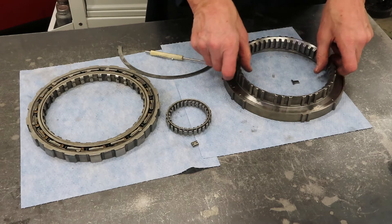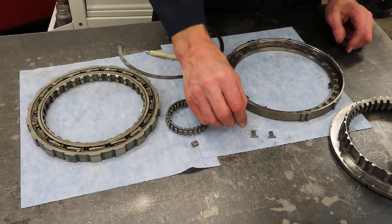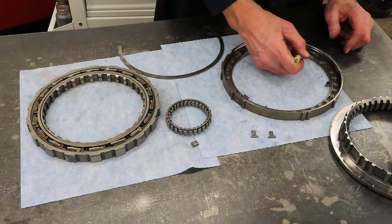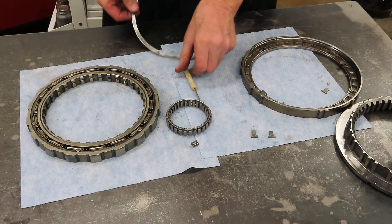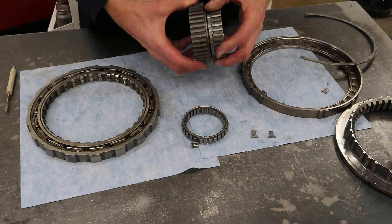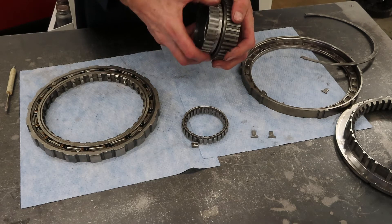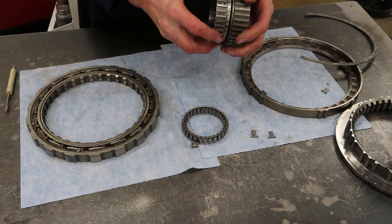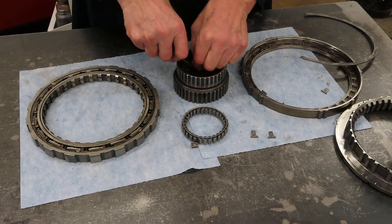Here are the elements and little springs that hold them in their little pockets. The element rides up its slope then dives off — that's the diode clutch, probably the least common style. Now here's a sprag application — a 4L60E. It's inside the hub associated with the forward clutch and the overrun clutch. There's also a friction and steel set of clutches on the overrun as well. Again, I can be driving the vehicle, let off the gas, and the drivetrain can keep rolling as it slows down.